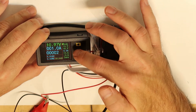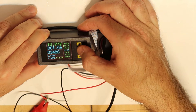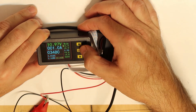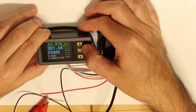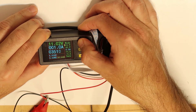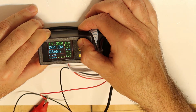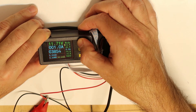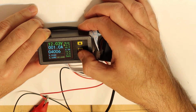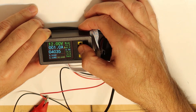In setting mode you can configure voltage for 10 volt and voltage for 40 volt — these are the suggested calibration points. I will go to the 10 volt setting because my power supply is exactly 12 volts. You press the up and down buttons until you match the real voltage from your power supply, in this case 12 volts.